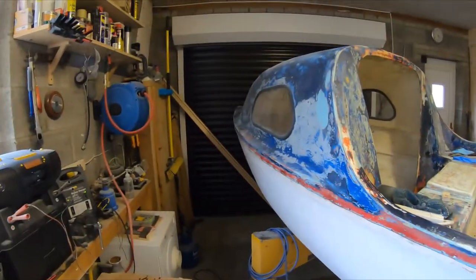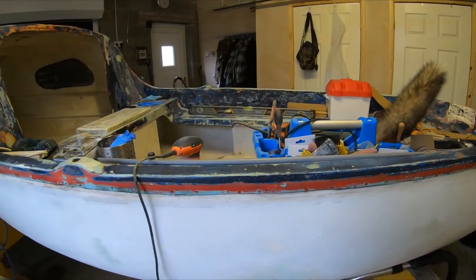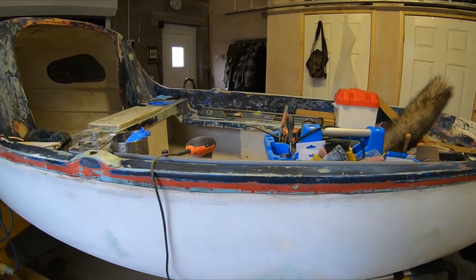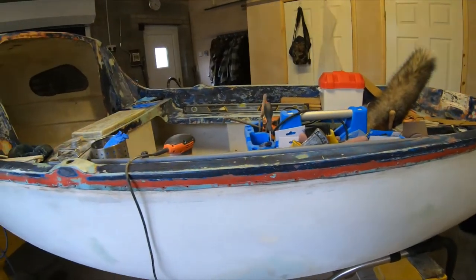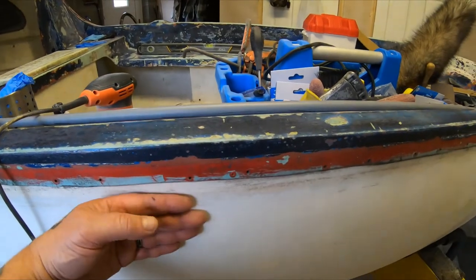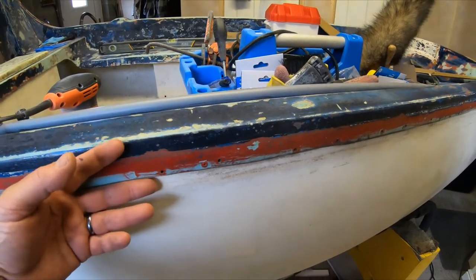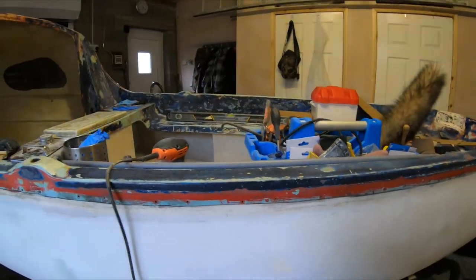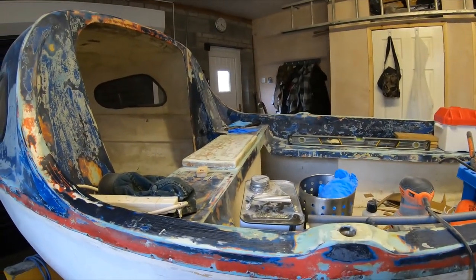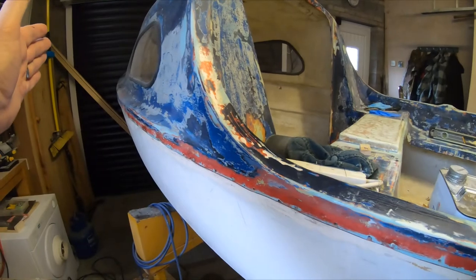I brought the timber over there for the edging strips here. There's what they call a wood resin hardener. For wood, it won't dint or scratch. You can hit it with a hammer, it won't mark it. So once I've got a router to them timbers, because of the lip on here, so it sits on the boat there, and the bit of router out will sit on here and it'll all be flush then, nice tight fit. And then at the front, I'll drill straight through and put six stainless steel nuts and bolts through, countersunk onto the front of the hull, because that's the biggest bend there.